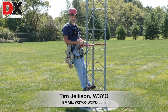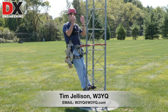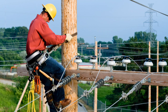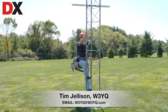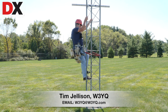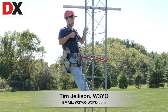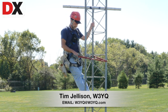You're a hundred percent tied off, always tied off to the structure while climbing. No exceptions, no free climbing. As you climb, you can use this equipment just like a lineman going up a telephone pole — you just keep jumping it up. Every step, this is a lot easier on you. Every step, you can let go if you want — you're not coming loose. If you're climbing a tower without this system and you're using fall arrest, you have to constantly be holding on, moving it, holding on, moving it. That tires you out a lot more.